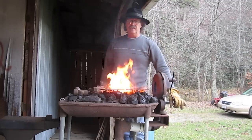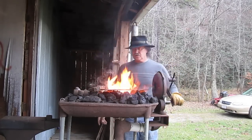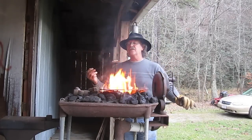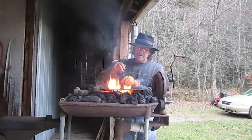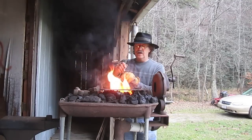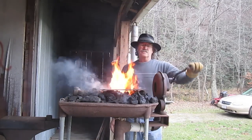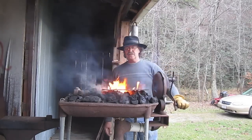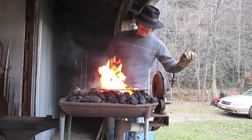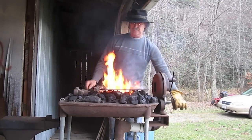Okay Jamie, beginners always go really fast with their air and that's going to cause your metal to burn. Here's how I test to see if it's got up to welding heat yet — I've got a coat hanger with the end hammered out really thin. All I've got to do is stick that in there on that piece, and if it glues itself to that piece, that stuff's coming to welding heat. If you see fireworks coming out of your fire, you've got your metal too hot — it's burning. So let's not burn this piece; let it soak there just a second.